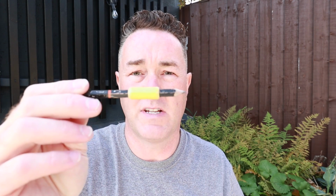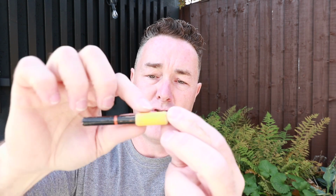Right, hanging brush. Oh, I've got a pencil here, an HB pencil, when you're paper hanging. Now you're going to say, why is the tape round it? You know when you overlap an internal angle and you need a few millimetre overlap round it. If you've got a pencil with some tape round it, you can run that tape into the angle down against the wall, and it holds you off from the corner just enough that allows the paper to wrap round. Make sense? So you run it down the corner, but it's not going into the angle, it's keeping you away from the corner, giving you a line to cut.